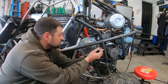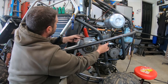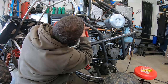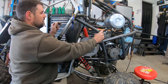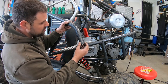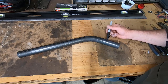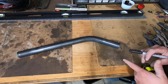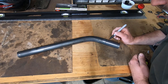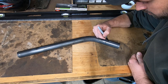So something like that. Now what we're going to do is make a mark, and then do the same up here. Now that we've got our marks we can start marking it up and actually see where our notches are going to be. We're going to have to notch this thing by hand. Here are our marks — I went over a half inch, and from this mark I know it's going to be a 90-degree angle going straight in, so I'm going to start right here and trace to the edge and draw a line that way.